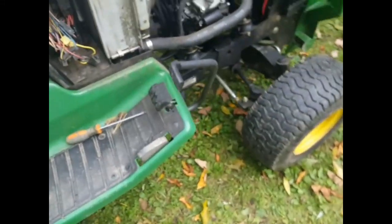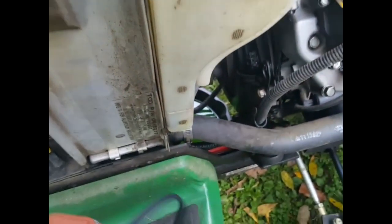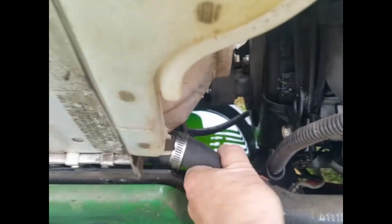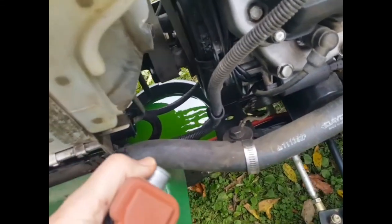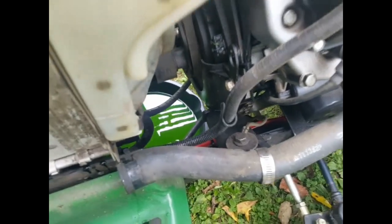What I'm going to do now is — I've made two red marks where this is going to fit very nicely, so it's about an inch I'm going to be cutting out of the lower radiator hose. I've loosened off this end so I can remove it. I'm going to make my first cut, then my second cut, put the radiator heater in place, and close up the hose.